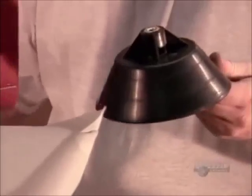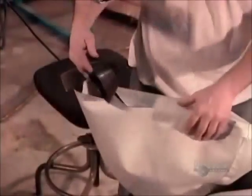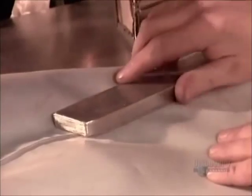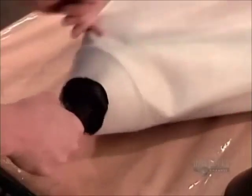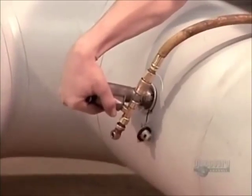Next come the cones. Cones support the weight of the motor and enable the boat to plane — to rise above the water when traveling at high speed. Using the propane flame machine, workers seal together the ends of the boat, then insert the inside cone piece just before they close it up completely. They finish off the seal using the high-frequency welding machine, then pull the cone piece through. They inflate the boat until the pressure forces the cone piece into place.